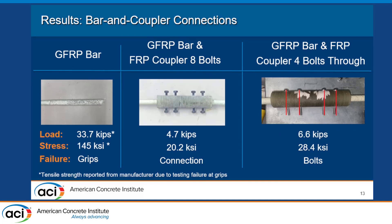We did test a plain GFRP bar to see what results we'd get and observe the behavior of a more brittle material. However, from the picture you can see it failed in the grips — the grips crushed the ends of the bar — which does not comply with the ASTM standard for testing tensile properties of FRP composite bars. So we reported the manufacturer's stated strength of 145 KSI, or 33.7 kips. The good news is that our other GFRP coupler setups never got close to the load that crushed the bar in the grips — that happened at around 11.9 kips, while our highest other setup was not even seven kips. If that had occurred, we would have constructed an anchor to protect the bar end in the grips.